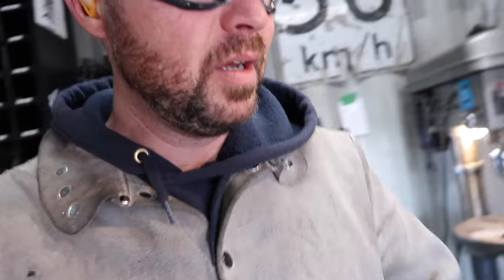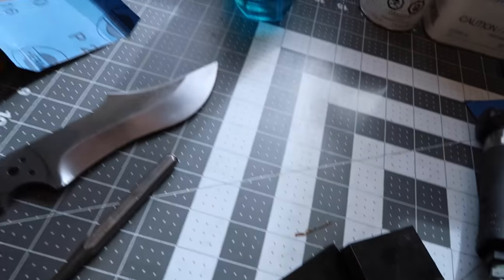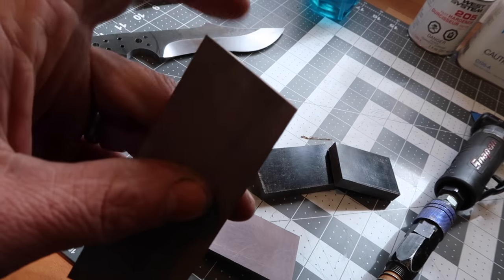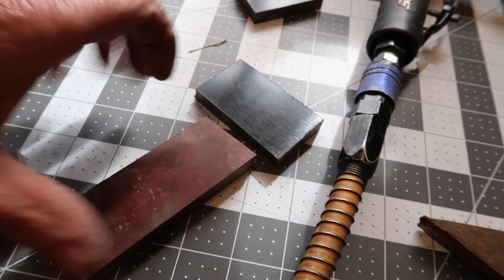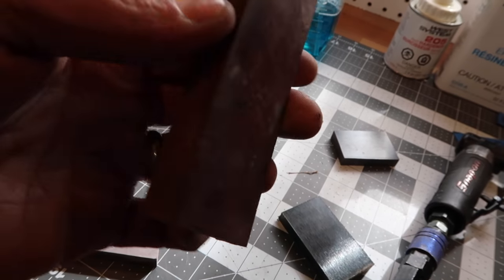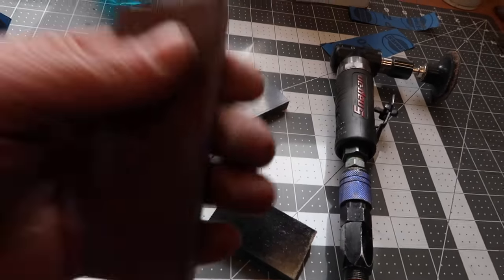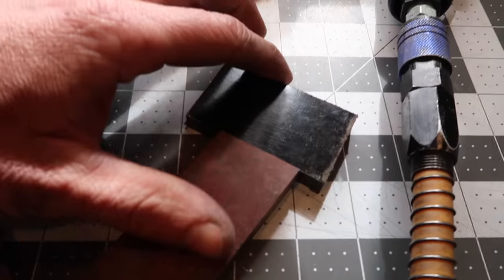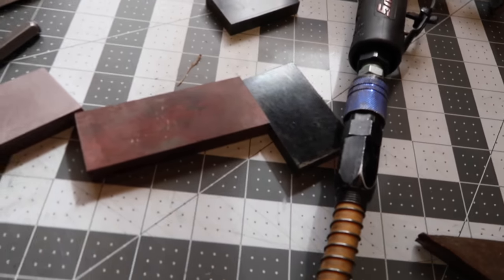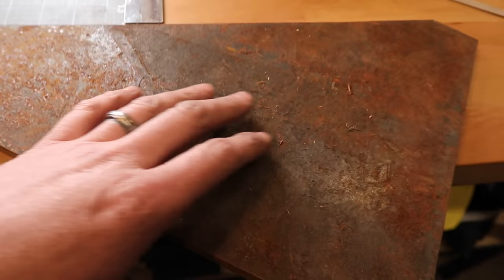I'm going to get a little more workable temperature in here. I've got a couple of scales to glue up for this blade. This is some interesting stuff — I just flattened this out in my milling machine. This is a black canvas micarta. I forget what this other material is — I got it at knifemaker.ca. If I remember I'll put it in the description. It's very brittle when you're machining it — it chips really easy, so I had to take it easy on the milling machine. I'm going to glue these together with a G10 liner and I want a nice flat surface to glue it to, so I've got this piece of scrap steel, but I've got to get the rust off it first.